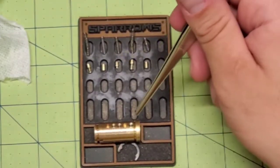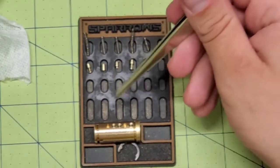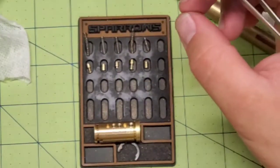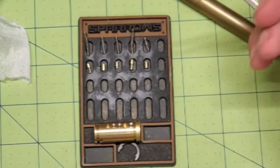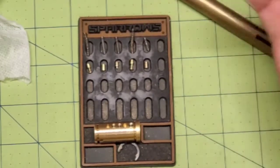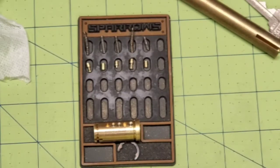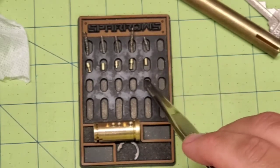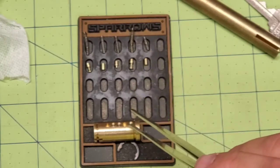Now on the back side of that, in these chamber one, chamber three, and chamber four, where they're super shallow, I want super light spring tension on those, so that those are more easily overset. You got to remember, when we're making challenge locks, as much as I love to see somebody be able to open up a lock, when I'm making a challenge lock, I am trying to defeat the other picker. And I want to set them up to fail as many times or as many ways as I can. So I pick super light springs to go in those super shallow chambers.